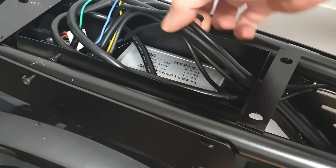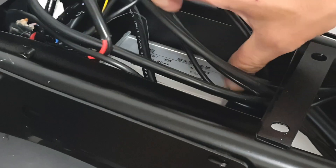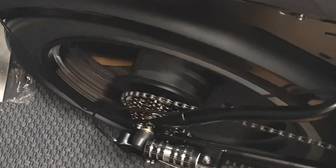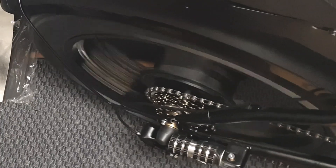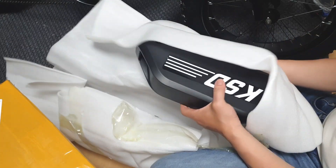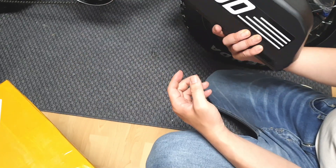Even though it's labeled as a 48V 750W product, the controller indicates a rated output of a 500W product was used — just like electric bicycles and cars. There's a lot of exaggerated advertising, claiming peak output for a few seconds as a standard, which can be considered somewhat misleading. Since the battery capacity I chose isn't large, at 12Ah, it can't deliver a 750W output from the start.